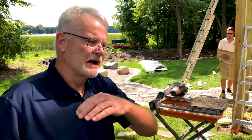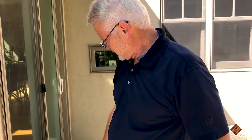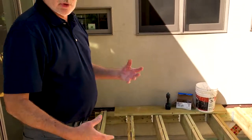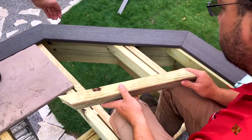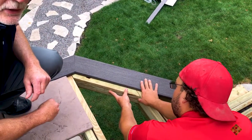First he cuts the tile and then holds it at a 45-degree angle to a saw and relieves that sharp edge so it looks better on the deck once it's set. We're up here putting tile on the deck now. He's already cut his first row — cutting those first, and then we're going to set them. Right now we're just loose laying these tiles; they're not set yet. We're just placing them where we want them so we can mix the colors properly — making sure there's not a bunch of dark ones in one spot and light ones in another. Right here we're going to have to cut a 45-degree angle in some tiles, and you must put an angle reinforcement in there to hold up that 45-cut edge, otherwise it will definitely break.